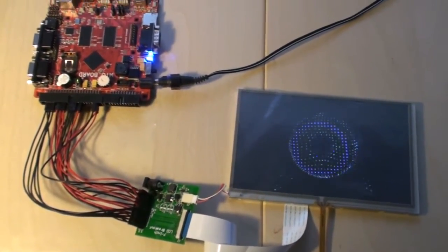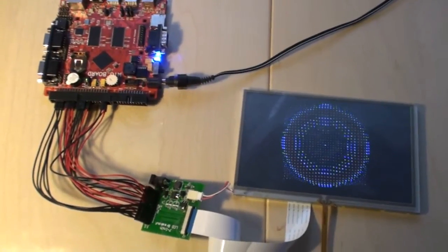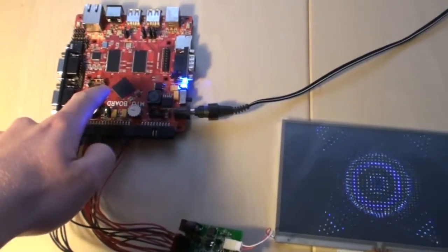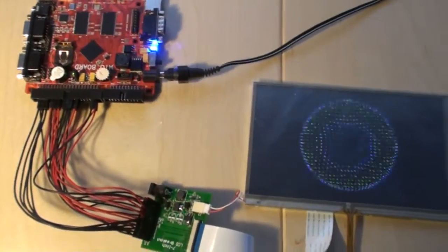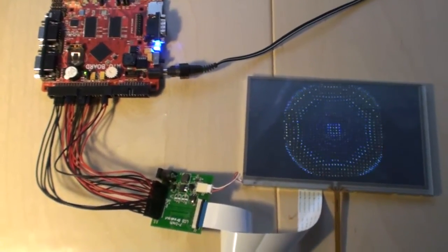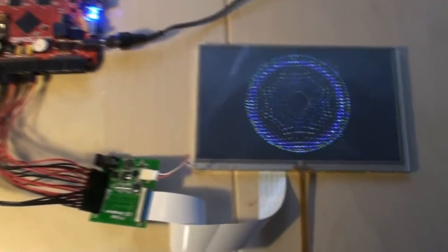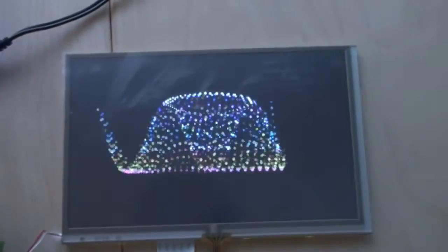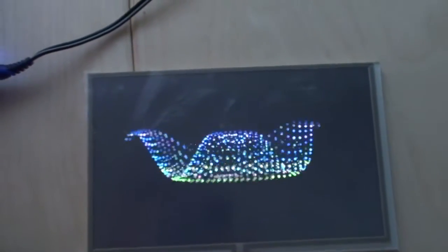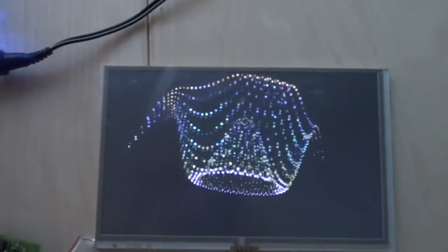All this graphics rendering is done very quickly compared to other displays which we've shown in quite a few videos, where you connect a display in parallel to a microprocessor. But this time the display controller is built inside, so you don't have to write pixels to an external controller — you simply write to the specific RAM address. This example is a 3D matrix demo where I use a potentiometer to turn the orientation of the 3D view, rendering a sine wave in 3D space.